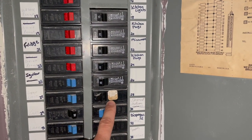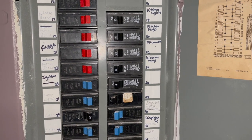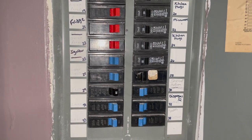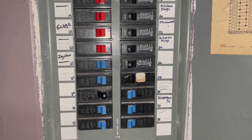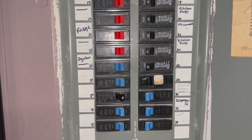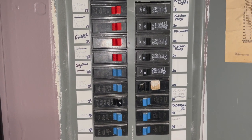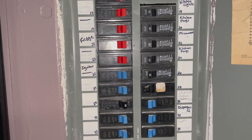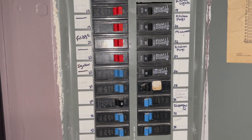If you look at this one, this is an older one. There was one just above it that recently failed, and what I want to show you is what it actually looks like. The first symptom in this room was a funny smell — it was actually a combination of burnt insulation from the wire and ammonia.